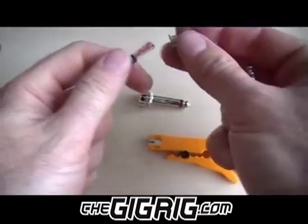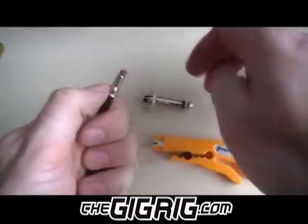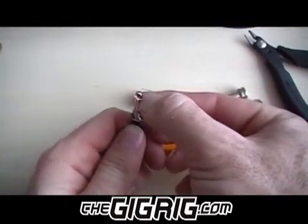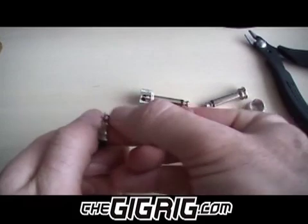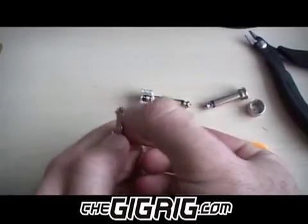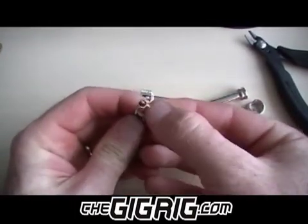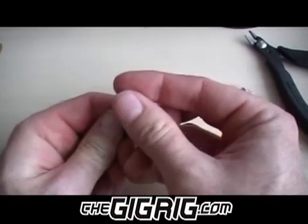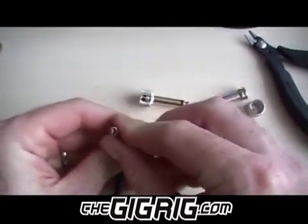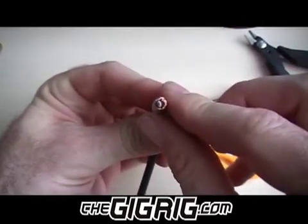First is the shield. Now the shield goes straight over the edge. Now here's what we do. We take this copper braid and fold it over. Okay. Make sure we get all that copper braid over the edge. This is one of the reasons why this system is so good, because it gives you such a fantastic earth connection. Now once that's down, something I like to do, we need to get this little cable centered.